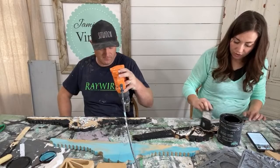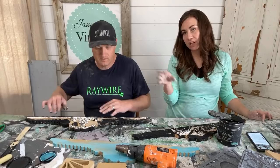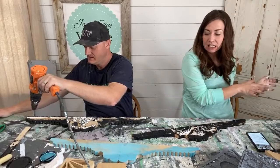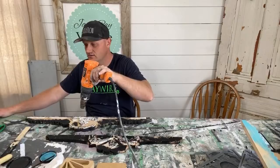So I just knocked the peaks down a little bit before it got too dry — you don't want them to be sharp. I'm going to find a clean paintbrush. So the salt wash is black velvet mixed together, and I also used just Little Black Dress. It's very dark — it's hard to see the texture, but once we add the light color on top, it's going to pop so good. You can put salt wash in any paint as an additive — let me show you close. It always gets worse before it gets better.